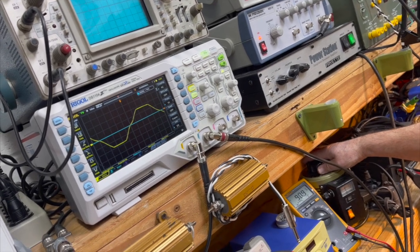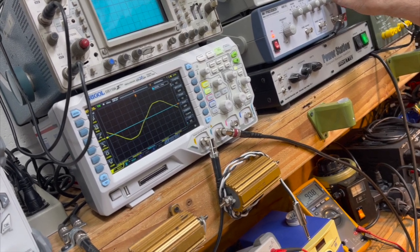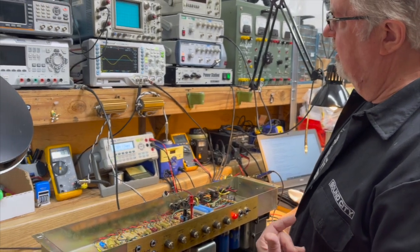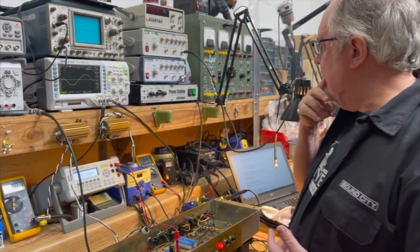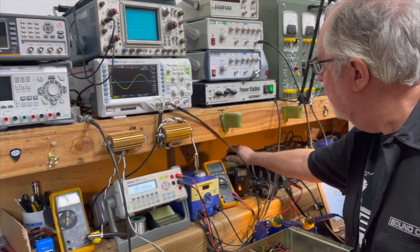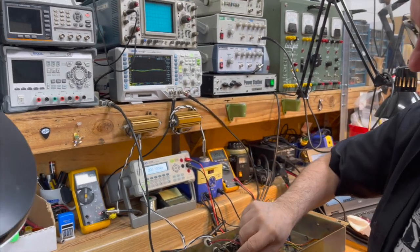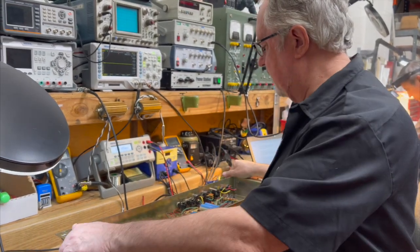Look at that. Smash. Yeah, total smash. Now, with the variac down like this, like we did on Dave's end, we're going to want to jack the bias down so that they draw more current. But before we do that, we're going to set it at the normal voltage. And we're going to play through it at the normal voltage and the normal bias setting into a cab.